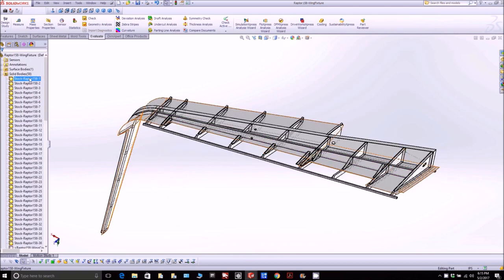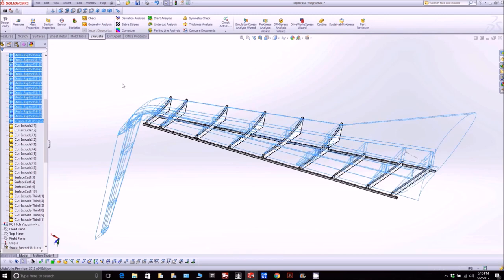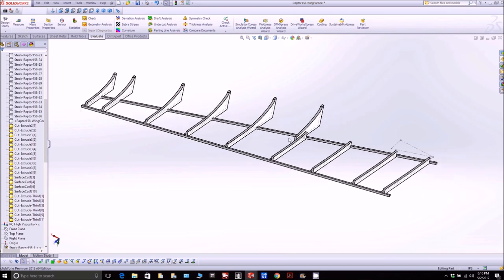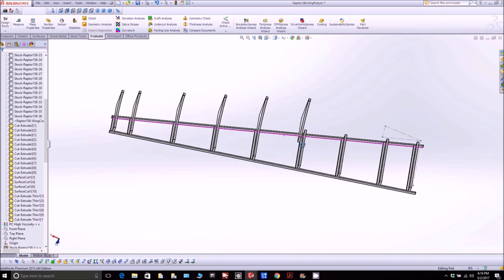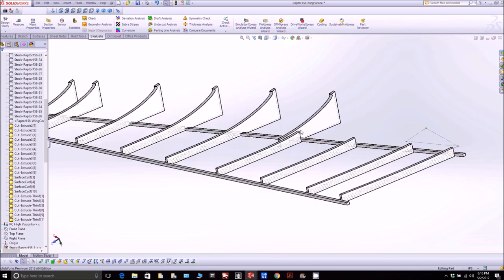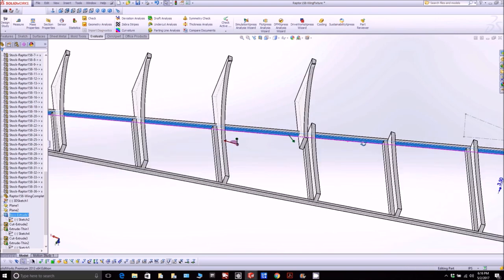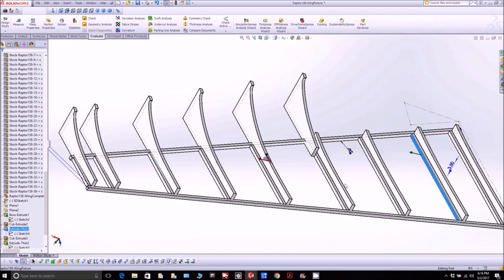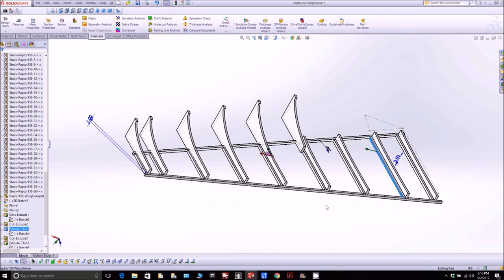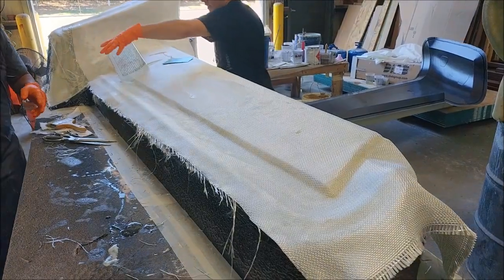You may recall the guys working on laying up a fixture on the upper wing skin mold. We decided to approach this differently — we're going to create the fixture out of a steel frame, then bolt something like FR4 to it, and have the machine mill the top edges. The end result will have a steel frame on the bottom with fiberglass pieces about one inch thick to support the various rib locations, and steel bracing throughout. Doing it this way will save a lot of manpower compared to our normal layup approach.